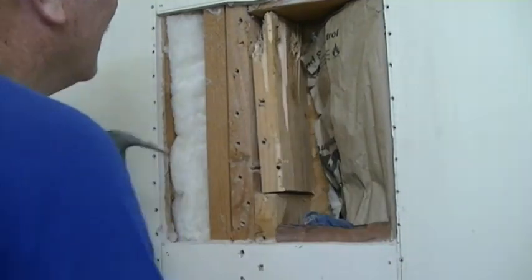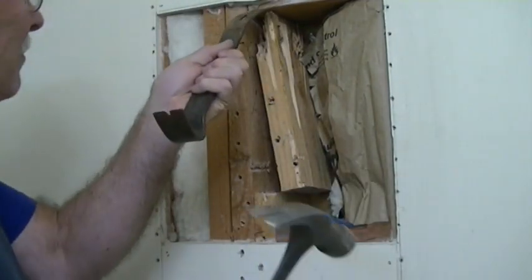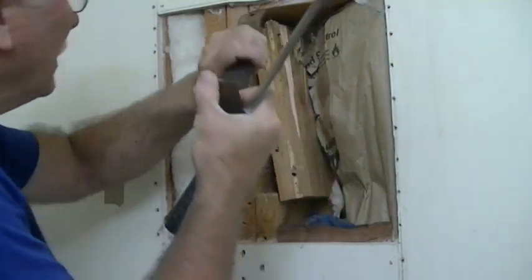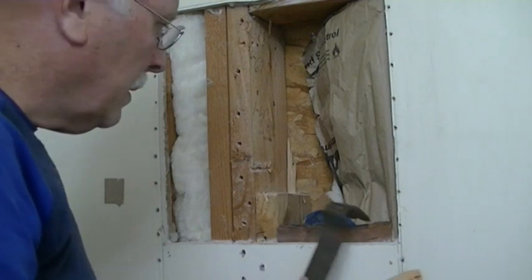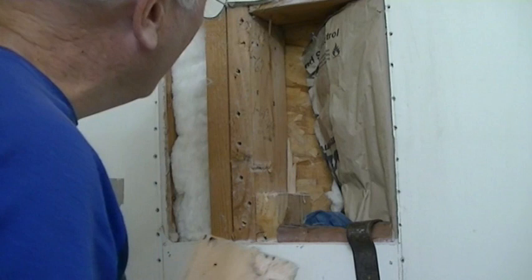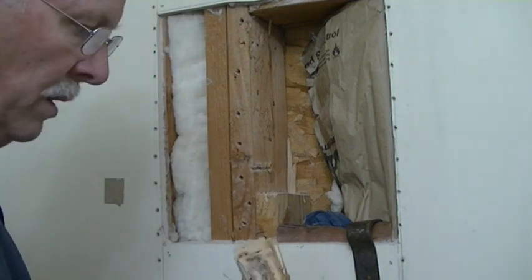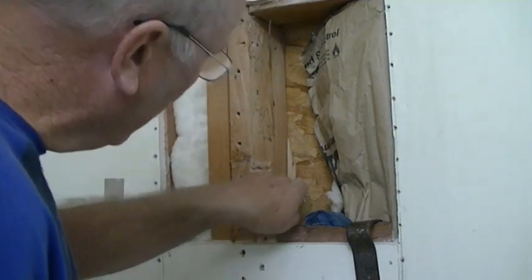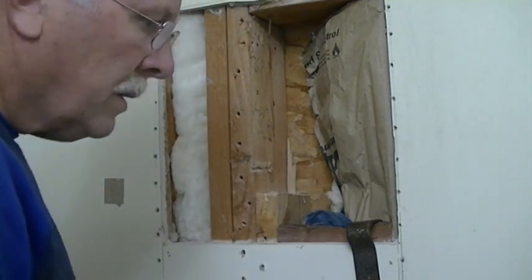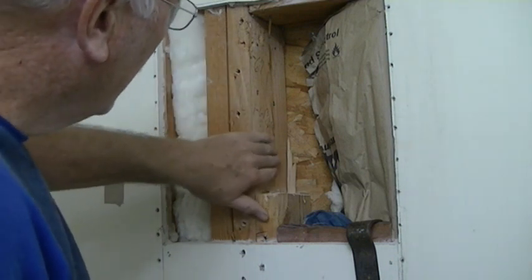It broke out pretty nicely. There was a nail coming in from the top, so we had to pull it away from that. That piece is now gone — there's a little bit of activity right there but we got 99% of it. I'll cut these nails off and put a new piece in. I'm also going to cut this open so we can find the nesting area deep inside. I scribed it across and cut as straight as possible. I'll measure this out, get a piece cut, and go ahead and glue it and nail it back in — it's that easy.